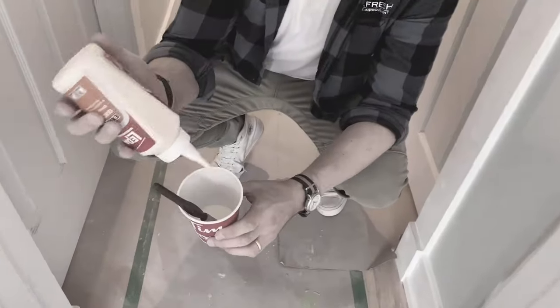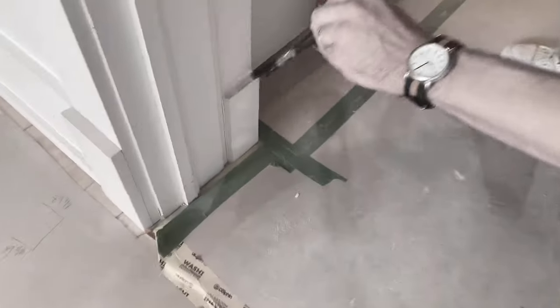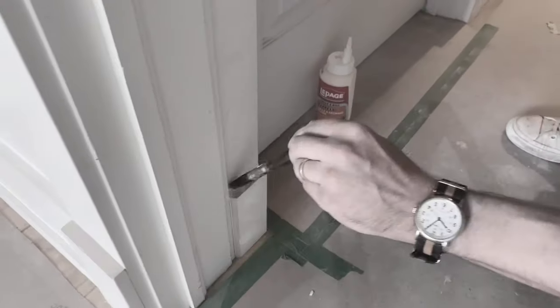All you have to do is dilute a little wood glue, nice and runny, and when it dries it'll seal that edge up so that I can sand it flat and get a nice smooth painted edge.